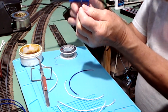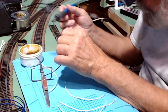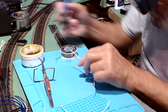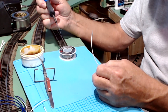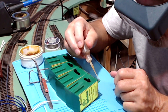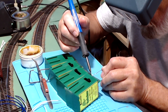Let's go cut and solder some wire. I cut approximately six inches of lead to solder to my tortoise switch machine. Whenever using stranded wire it's a good idea to tin the ends of it. One end is going to be soldered and the other one is going to go in a terminal, and tinning makes it a little bit stiffer for the terminal. I'm adding flux to each one of the terminals that I'm going to be soldering the wire to, and also putting a dab of solder on each terminal to make it easier to take the wire.